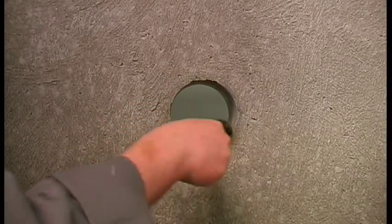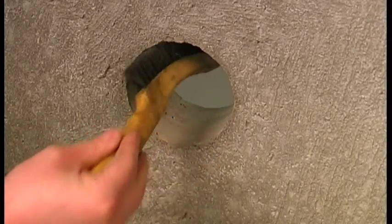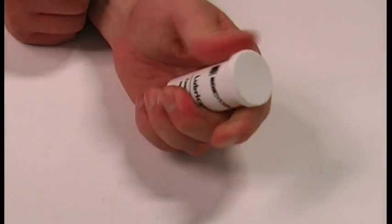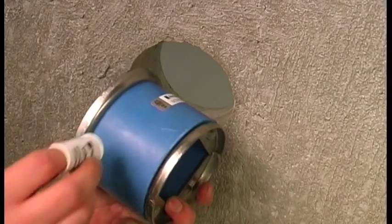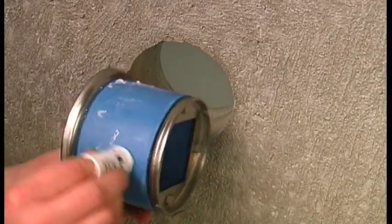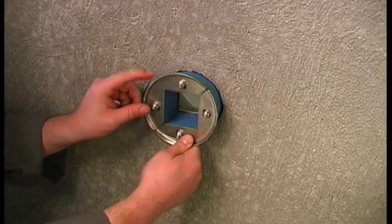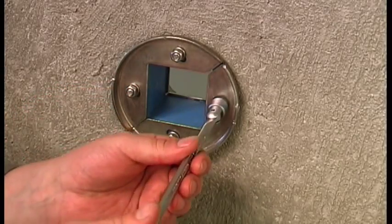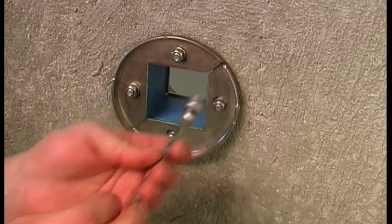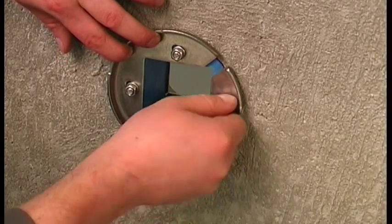Clean the inside of the hole. Warm up the lubricant stick in your hand and lubricate the outside of the R-frame, then insert it into the hole. Push the front fittings of the frame to the sides and lubricate the inside of the frame.